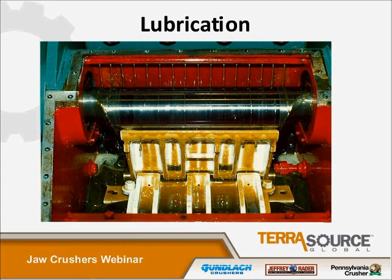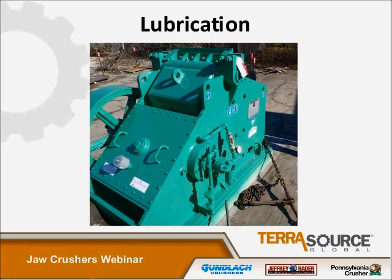The pitman and toggle mechanism require an oil bath lubrication. This picture shows the interior of the reservoir where these components are in operation. Towards the top of the picture you can see oil streams coming down from the spray bar. The oil comes down onto the eccentric shaft and lubricates all the components and main faces as it flows downward, then is recirculated through the lube system. The complete lube system is included with the jaw and has all the necessary components — pump, filter, flow switch, oil pressure gauge, and so on. The pumps are shaft-driven, so no other external power is required.